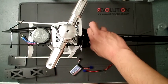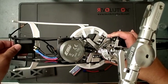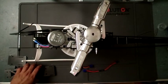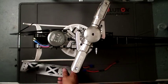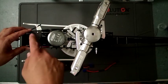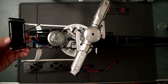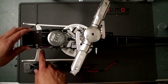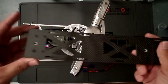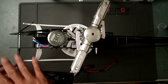Now, the other setup I've done is I had the controller at the front, like so, and basically the tray for the ESC bolts in the front, ESC is right here, right? The wires for the motor just go over here, plug in here, so it's a pretty clean setup. Controller right down in the front, ESC, and then the battery tray was configured like this, so the batteries are in more to compensate for the additional weight in the front.